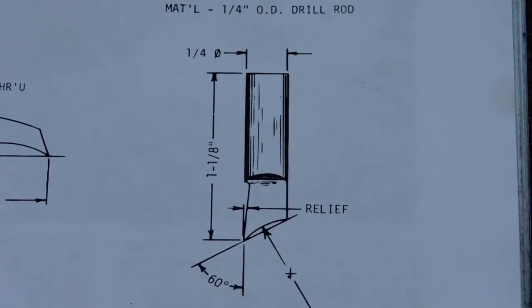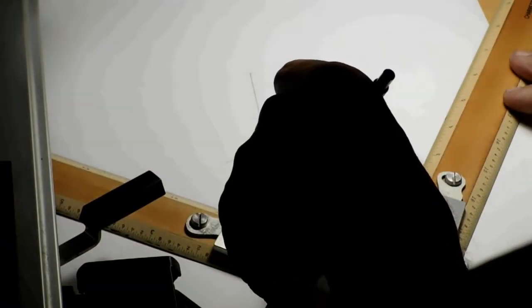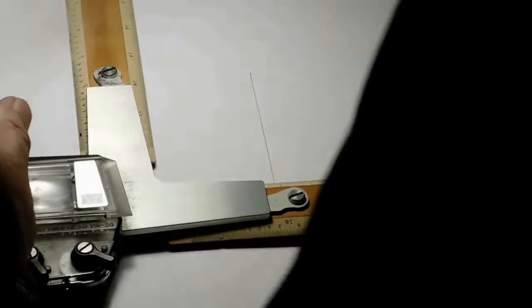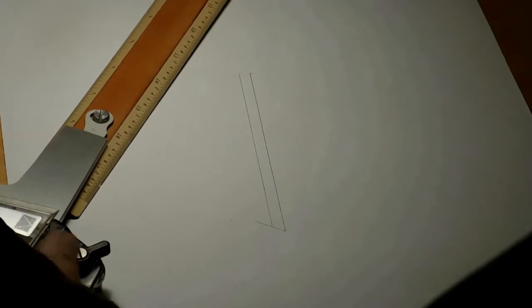This is W.R. Smith's drawing of the cutter that he was going to use. I actually use high-speed steel, so I have to make a different drawing. I'm just using his dimensions and copying it out here so that when I make mine out of high-speed steel I'll have something to reference, just to make sure I'm within his guidelines for the cutter for the ratchet. It's a quarter inch piece of high-speed steel and we're going to put the angle of the cutter in there.